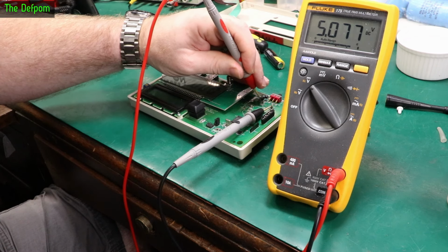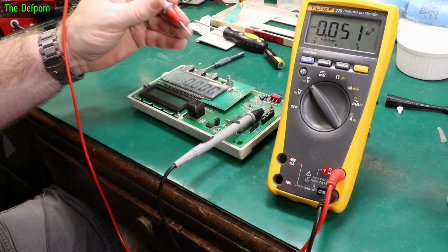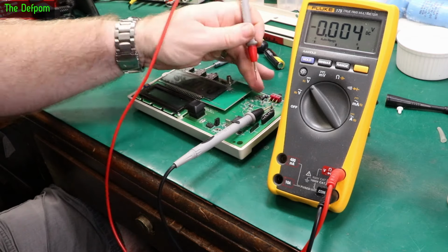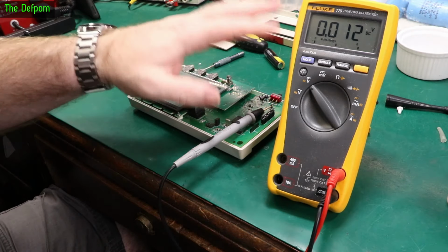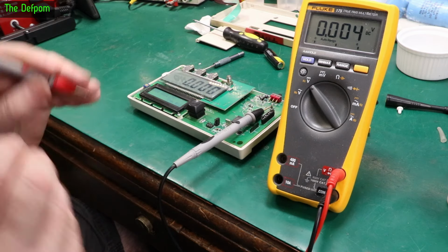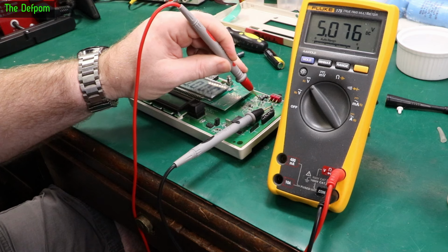That's dropped very slightly, just a few millivolts, but that's way better than it was before. It was drifting everywhere before, so that is a great improvement. Let's check over here. Yes, same. So no issues there. Don't forget as well, I was doing hot air on this thing before to bed everything down, so it probably was a little bit warmer, so it's still stabilizing to room temperature. So a shift wouldn't be unsurprising. Just a very small shift for temperature.